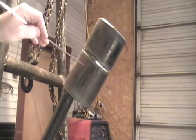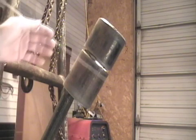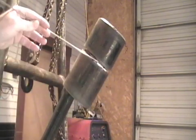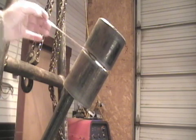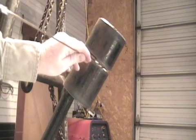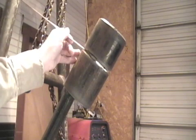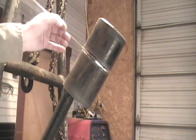What I'm going to do is walk you through it — there won't be much talking while I film. I'm going to thin my tacks like we normally would. I've got 3 tacks in the form of the peace sign with no tack on the bottom whatsoever. I'm going to take the grinder and thin this out on both sides because it's tight on top. With 3 tacks and none on this side, that's why this side is still a little open and the other side is extremely tight because it drew. So I'm going to thin this out on the back side.